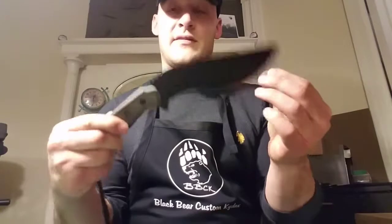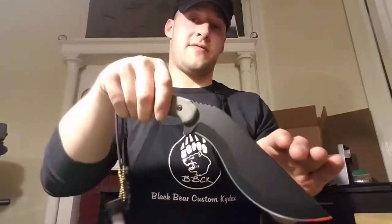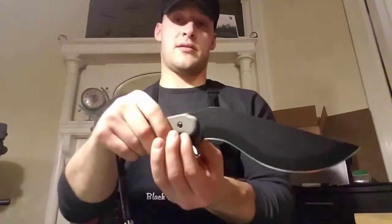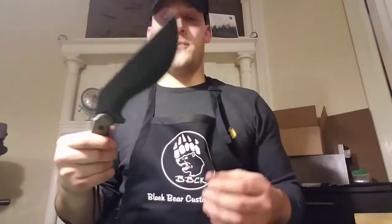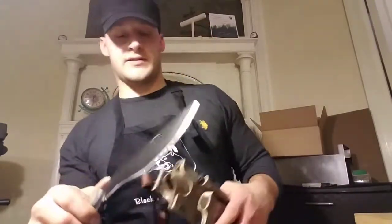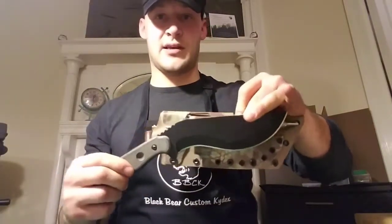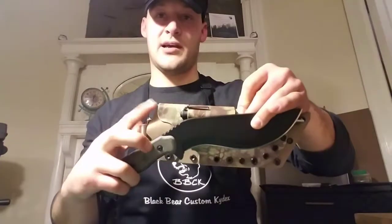You have to come up with ways to create space so it draws smoothly. This is the first Kukri I've done. The most successful design I'd seen was a sheath with an open spine — you put the tip in first and seat it downward, almost like a chopping motion, and the click happens on the handle. It's a great design, but I wanted something unique. What I did instead was fold the Kydex over the flat of the spine, so it goes in just like this. Then I did a little creative molding to keep the space up here open.